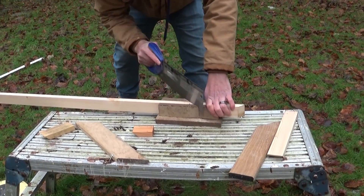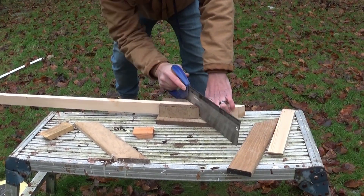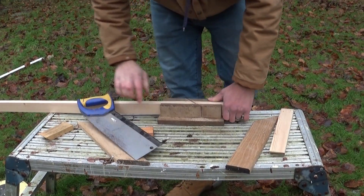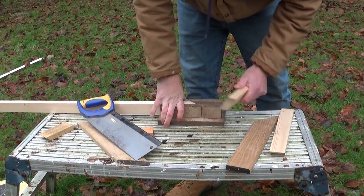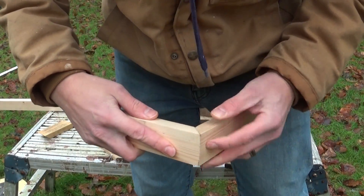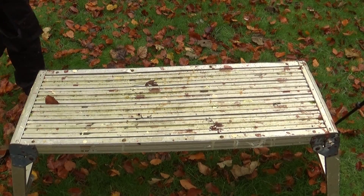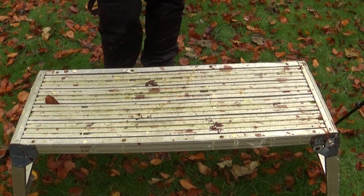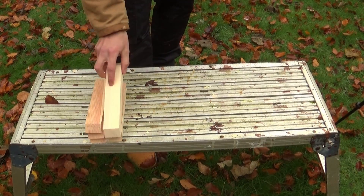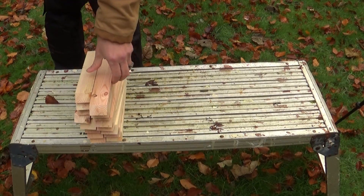So there were only three different sizes to cut from the 25x45 timber. Four were cut at 510 millimeters — these are going to be stretcher plates underneath the shelving to make it a little bit stronger. Then I had 16 at 220 millimeters and 16 at 300 millimeters — these last ones make up the support boxes.